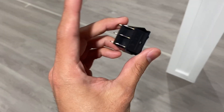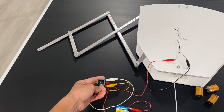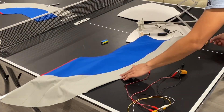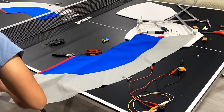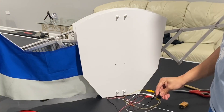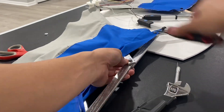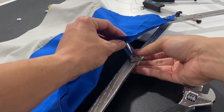To control the wings I used this double pole double throw switch, which I did some test wiring on to make sure it works well. What's nice about these switches is that it has a forward and reverse, which works perfect for what I want. Now I'm installing the wing onto the linkage — here's a quick test of it opening and closing. To install the wing onto the linkage I just undo some of the shoulder screws, thread that screw into a hole in the fabric that I made, reinstall the screw, and now the wing moves with the linkage.